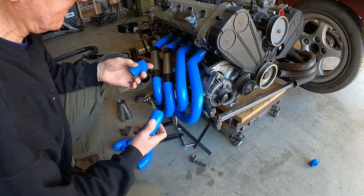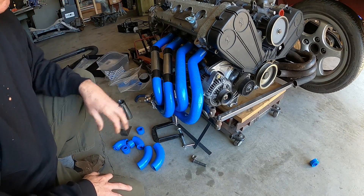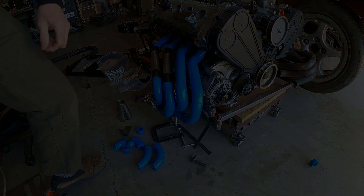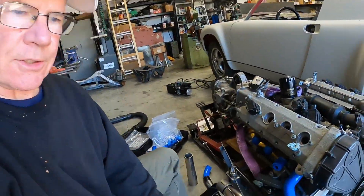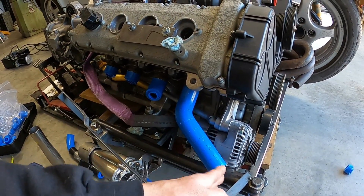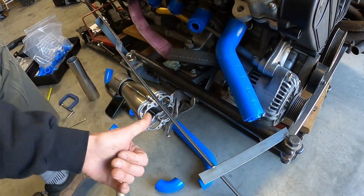That's the Ice Engine Works kit — a little bit of watching how it's done. I hope that was interesting. Next time it should be changing this out to steel and getting things tacked together. Actually, after all that, I'm going to start over again and move the collector backwards. I'll be able to get the O2 sensor back there where there isn't anything in the way. I want a lot more freedom anyway, and it's going to be easier because the tubes are starting to get pretty close at the front. I think I can do a better job with everything moved back.